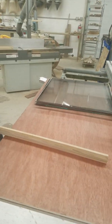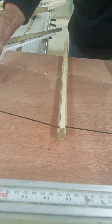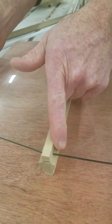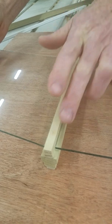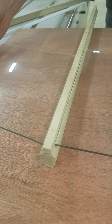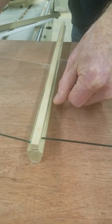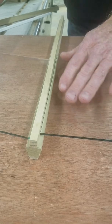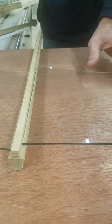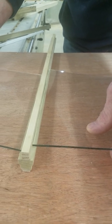Let's say we're on the outside of the house. We're going to take your two pieces of glass that go into the muntin and put it in like that, and then they'll take some glazing points and stick them in here to keep that from falling out. Then they'll cream some putty in here, and it'll be a nice little 45-degree angle bevel down to the glass — or so, it might be 30 degrees. They'll try to get it so that it's nice and even with the edge of the muntin itself, so that it doesn't protrude into the sight line or daylight. That's what we call this area here that is actually clear — the daylight. That's how it works on a typical window built 100 years ago, and that's probably what you have if you still have your old windows with muntins.